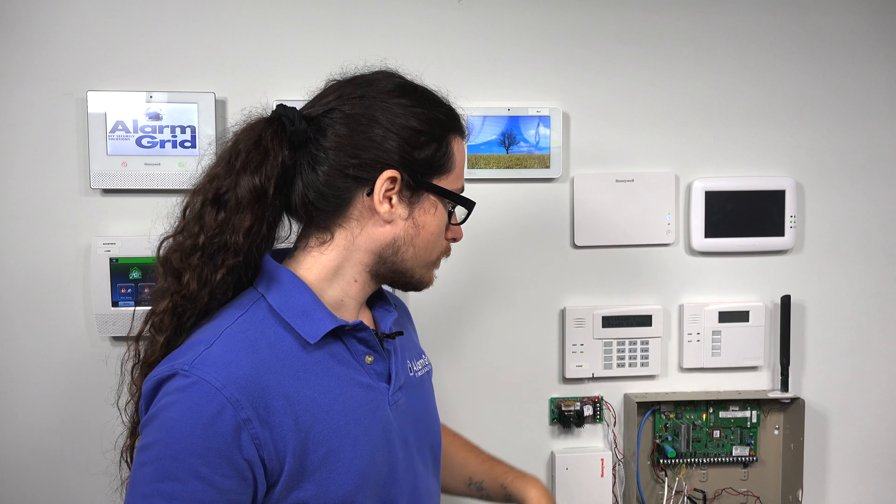To start off with the Vista, we have our Vista panel in a ready-to-arm state. I've wired resistors to zones one and two. I programmed zone one as a fire zone, which is usually how it's going to be set up, and zone two as a front door sensor — a normal burglar zone, entry-exit. You'll bypass a sensor if the zone is in trouble, basically if there's an issue and you don't have time to resolve it, or if you want to leave a window or door open while the system is armed — say you're at home, you do an arm stay, but it's breezy and you want to keep the windows open.